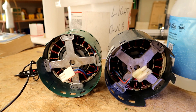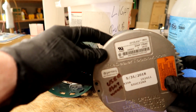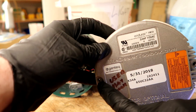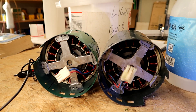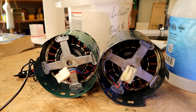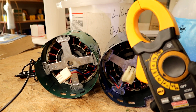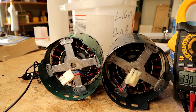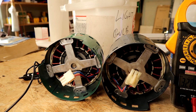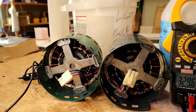The first thing you're going to have to do is pull the module off the back of the motor — it's just two screws, one on each side. Pull it off and set it out of the way. If the motor is acting goofy or not working, set your voltmeter to ohms — the little horseshoe symbol. I'm using a bottle so the motor doesn't roll around on me.